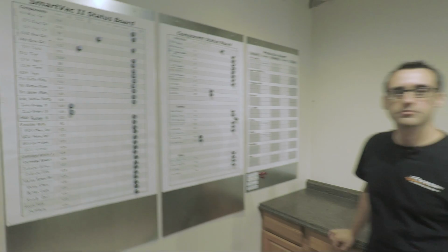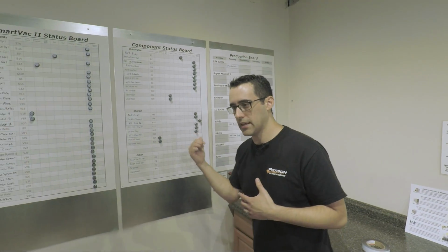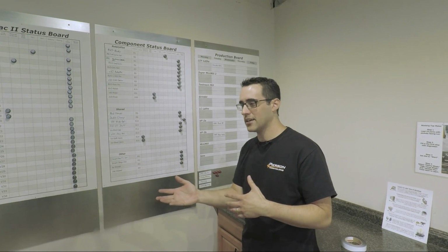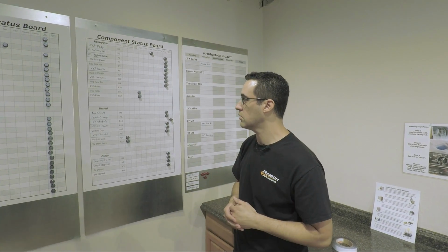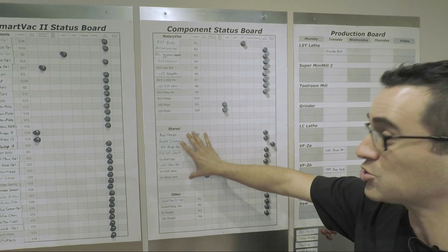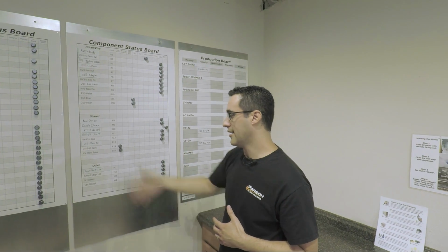Right. Because I remember the last time we were here, your Doosan lathe was running Venturis, and you said we make like 6 months' worth because it's so low, there's not that much material, money, or space tied up in inventory, so you might as well. Yeah. They come off finished, but if there were a part with a second op, there's no second op in that lathe, finished parts come off it, but we could do maybe 200, and then the last 100, let's put them in bonus stock, come back, and finish those 200 just to get product out the door. And of course our rotary vise is shared, because I try to share components between products. That's cool. So we'll do that, and then other little things.